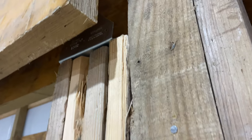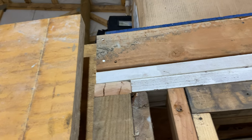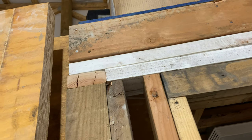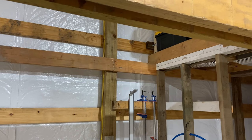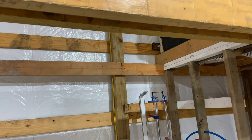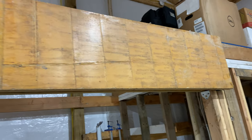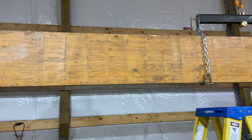For this type of utility storage it's going to be fine — plenty strong. I put all those posts in place and cut them to length so the top of this beam will be flush with the top of the rim joist, meaning I can just lay subfloor right on top. Then I'll lay two-by-six joists on top of that and use joist hangers on the face of this big beam, and we'll have a bunch of extra loft storage.